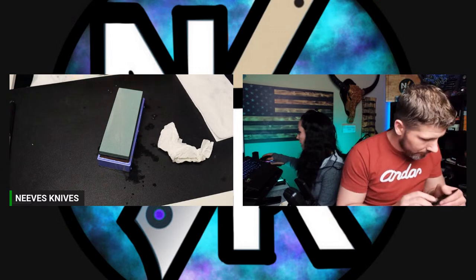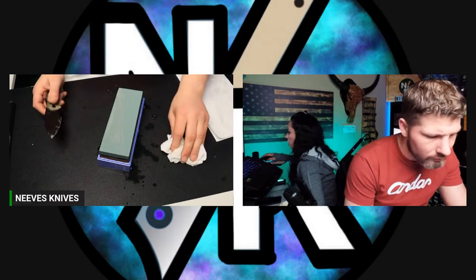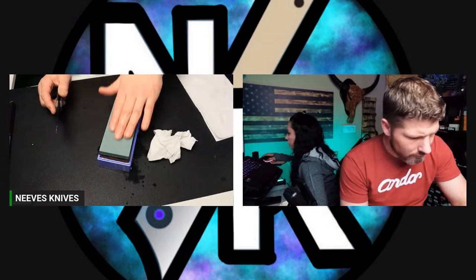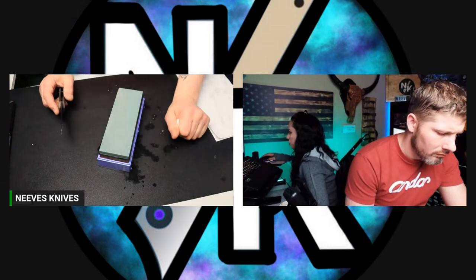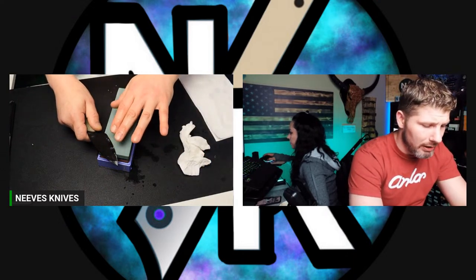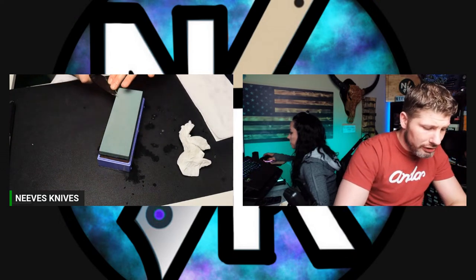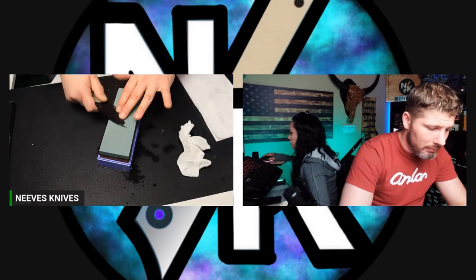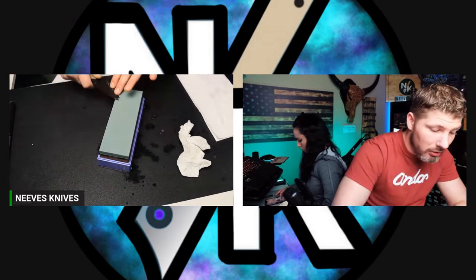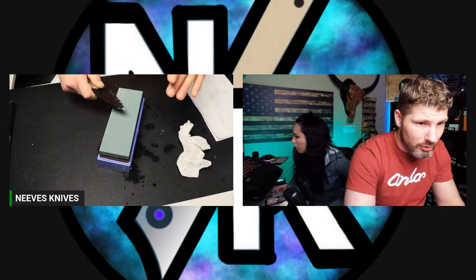When learning, if you don't have bad habits, would you learn to use both hands in the same direction versus push-pull with the dominant hand? I would say if you can, because some people are going to be better at going back and forth like this. You're going to be better at holding your angle going back and forth rather than picking it up and putting it down, because you might not be able to land back on your exact angle without having lots of experience. That's why I always say, lock your wrist.